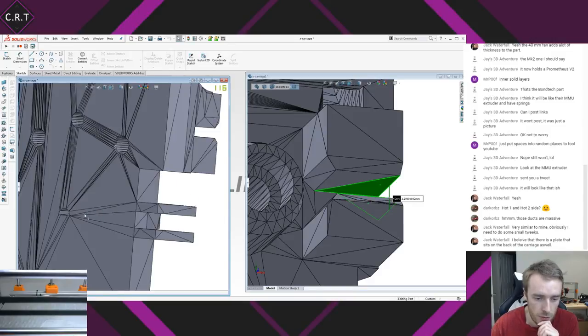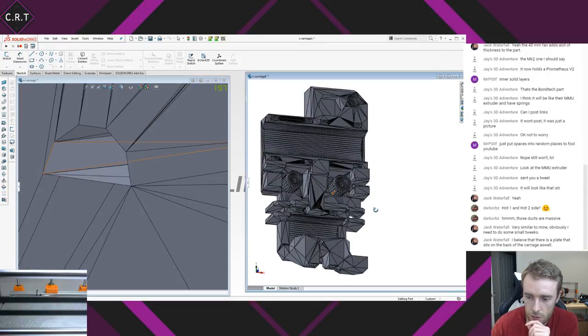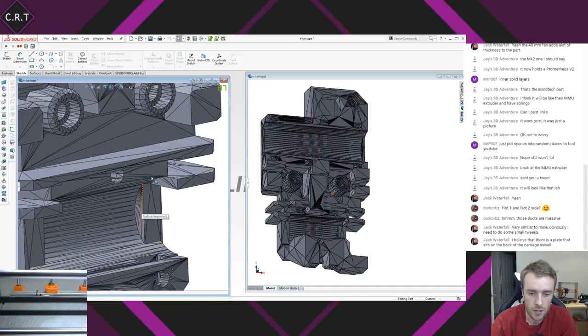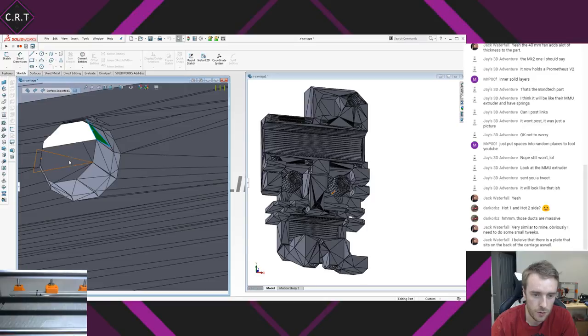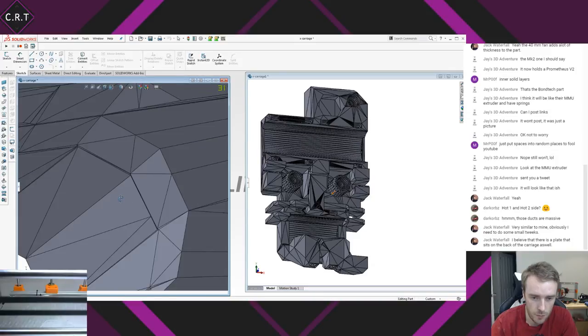But not sure it's going to, ooh, what the hell's that? So they have this filament that goes through to help support the cables as they go from the extruder to the control board. They have this piece of 3mm filament, 2.85mm filament, that sticks down in this hole and sort of comes back upwards out of the X carriage and then round to the control board. And that looks a little bit messy. Looks like they've just cut it off at a random point and it's just stuck there. That hole should probably go all the way through because you're going to have this funny little filament blob here that's really thin. Anyway, probably not a problem. Wow, what is going on with this hole?